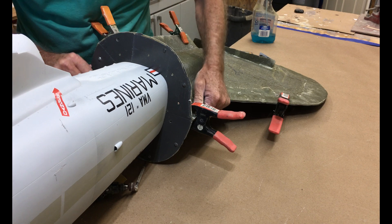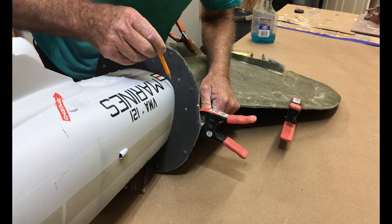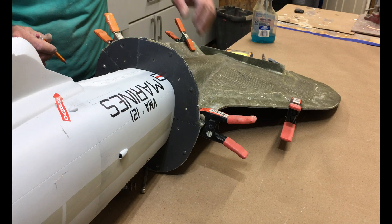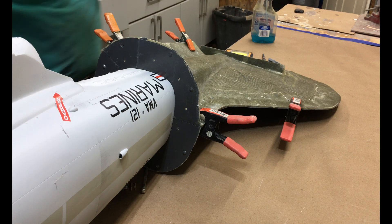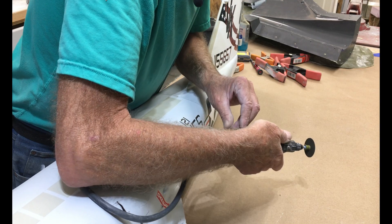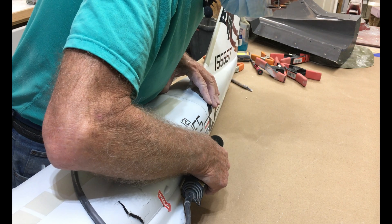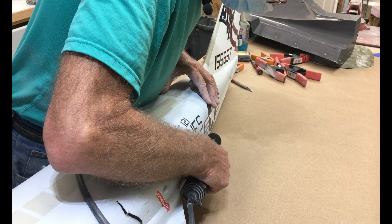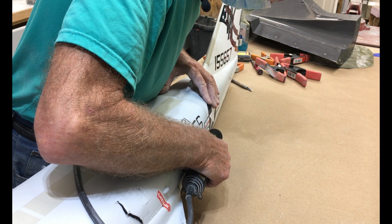When we splice them there will be a small gap, but the resin will fill that so it's not a problem. I'll sort this piece out by placing it in the mold when it's all cut. Now that we've got a nice fine line we can go ahead and cut it — I'm just using the Dremel with a cut-off wheel and that'll make sure it works.